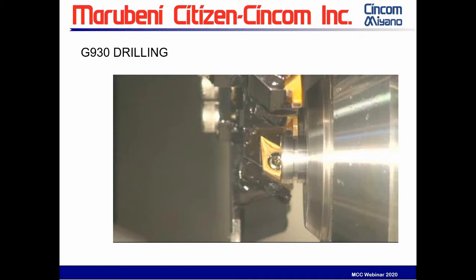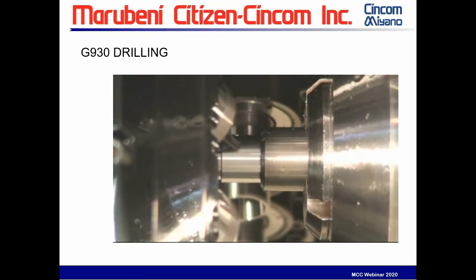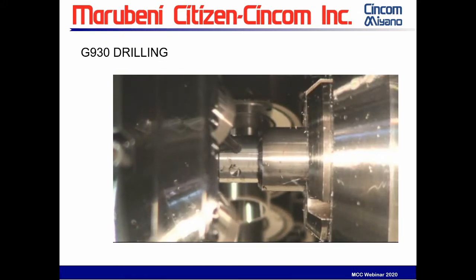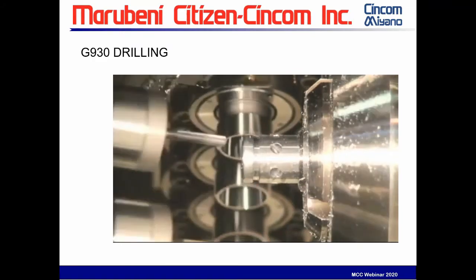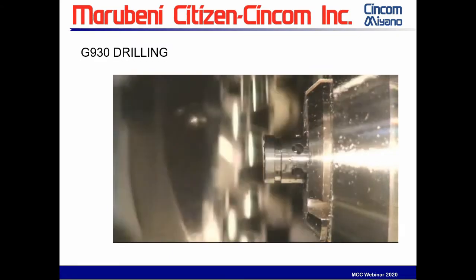Let's take a look. There's two ways of utilizing the B axis. The one is just what we call an axis coordinate rotation, where the B axis is rotated to a set angle. X, Y, and Z now become virtual, with the Z axis being the tool. So let's take a look at this. Those of you that aren't aware, Citizen Cincom has made programming these angles very simple. Basically, you program the angle, start point, and end point. The machine does all the calculations. A calculation has to be made to get that angle just right for the Y axis, and the machine does all that calculation.